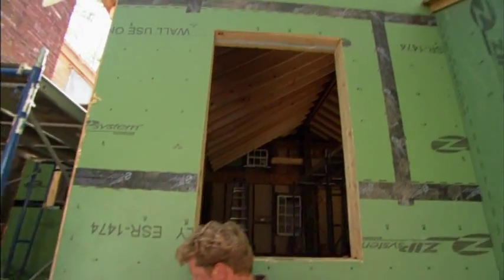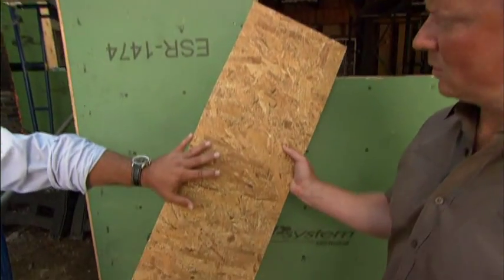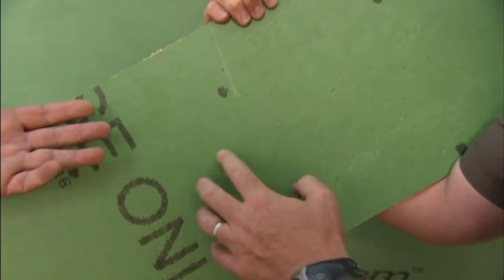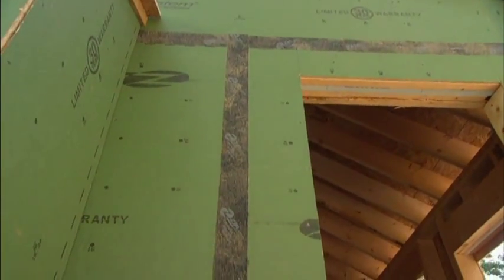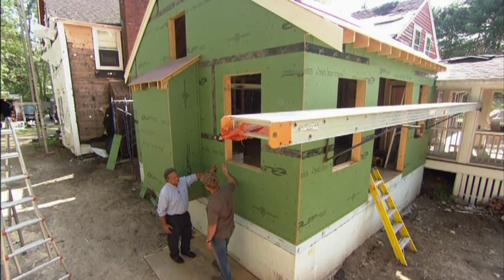So if it's keeping the air and water out, why are we getting rid of it and turning our houses green where there is no house wrap? It's even better now — we've saved a step, gotten rid of a layer, and don't have to go around the building more than once. This is like the paper right into the sheathing. We've taken a more dimensionally stable OSB with more resin content, and then we have a facer or lamina. Think of a facer as ultra-thin mosquito netting impregnated with latex paint that happens to be green in color. We impregnate it right into the OSB, and it makes it watertight — water can get on this, no problem. We tape the joints to handle both the water control and the air control. The facing actually helps the tape stick to do its job. This technology is pretty much the death knell for the traditional house wrap.